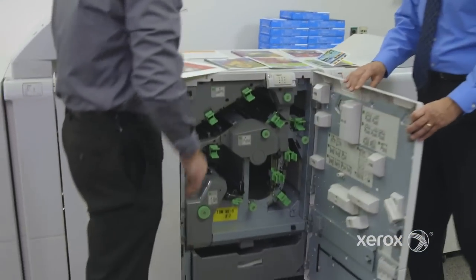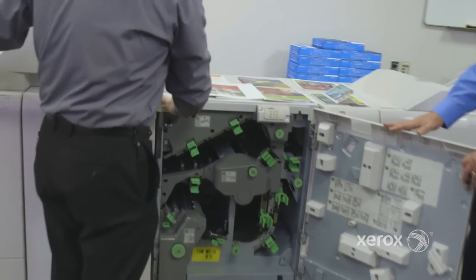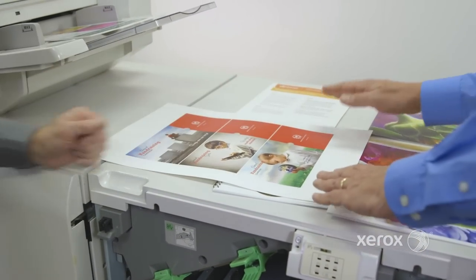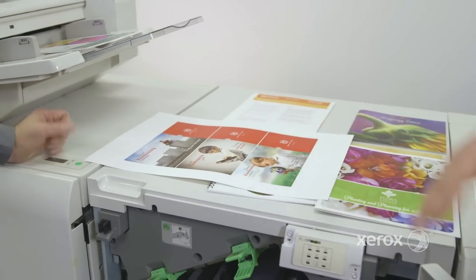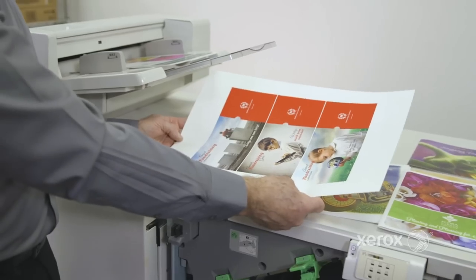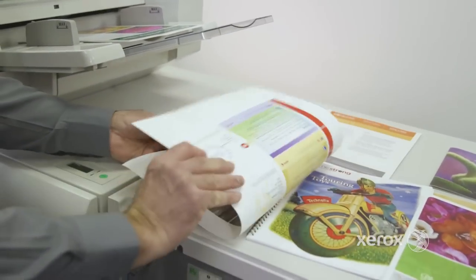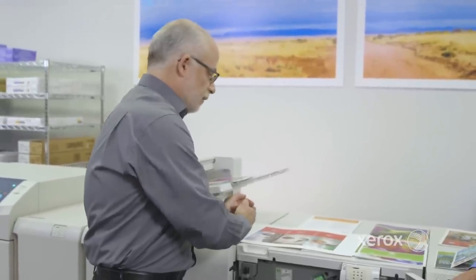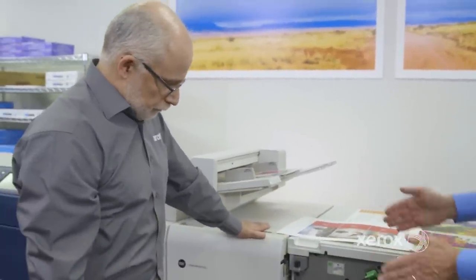This is the two-sided trimmer with a buffer. The two-sided trimmer takes material produced by the press and removes material at each of these edges — a head and a foot. This would be a typical orientation for a sheet destined for booklet making, where it's folded later. As each sheet passes through, they're cut by a rotary cutter and the rotary cutter keeps the image centered, with a small adjustment to align with an image that might be slightly off, as each sheet comes through that paper path.